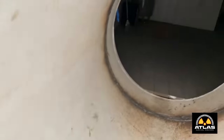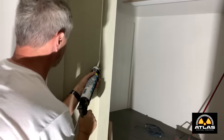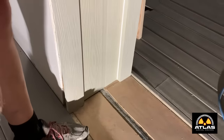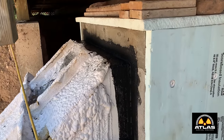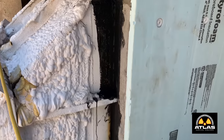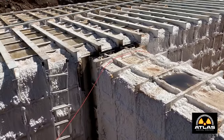Going back out into the bunker, I can almost walk in here and I'm tall. Now he's putting a string of caulk on the hardy board. It's really clean, nice job. So in here, to make it weather tight, we welded it and went ahead and put tar up there - it's a roofing tar - and down the sides as well, and over there where we welded everything.